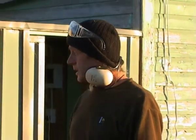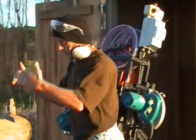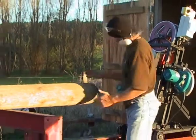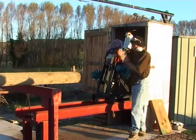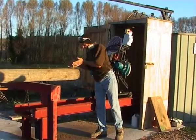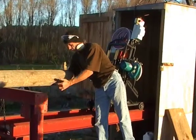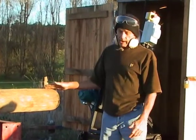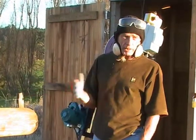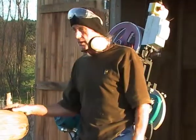Say this is 3 years worth of improving it, and what this will do is put the scarf on the pole at the angle that will become the pitch of the roof, and then the chainsaw will come through and rip. It'll leave 100 millimeters of timber on the pole, and then our offcuts will just fall away, and that pole will be ready to go out to the job. And it's all to do with assembling on the job, not cutting as we used to cut these things up ladders with a chainsaw, all wobbly and everything.